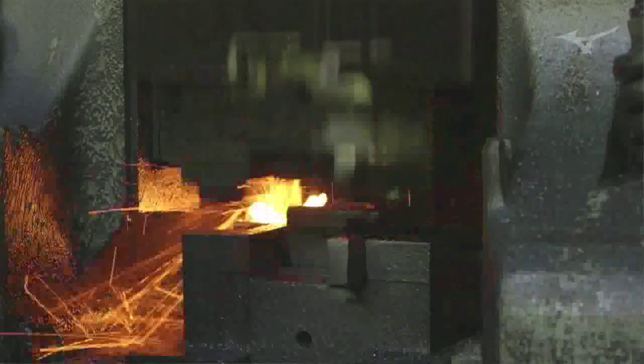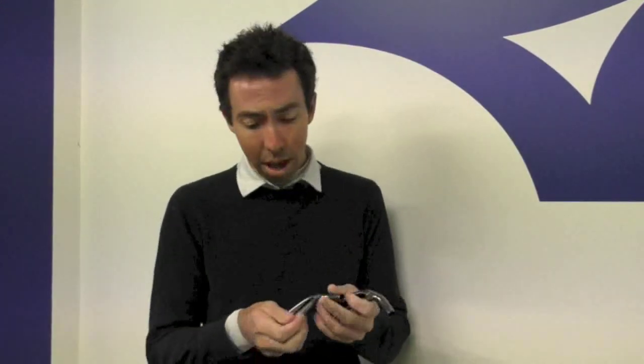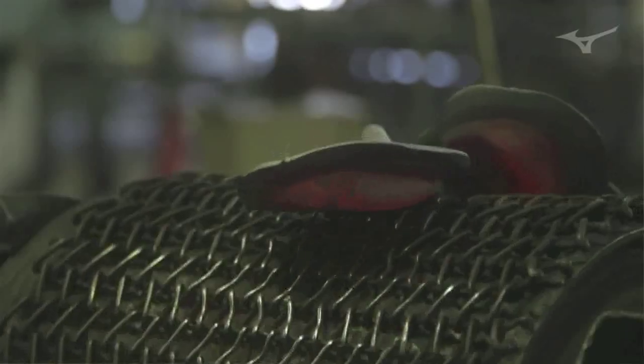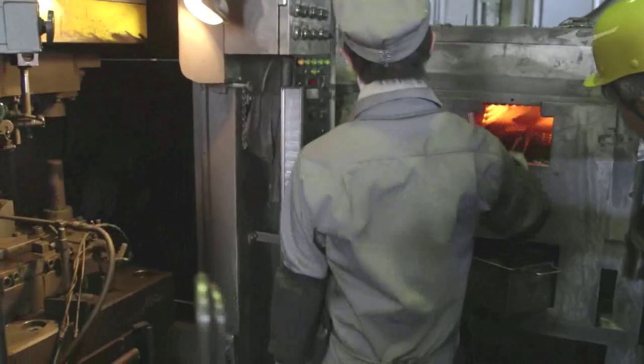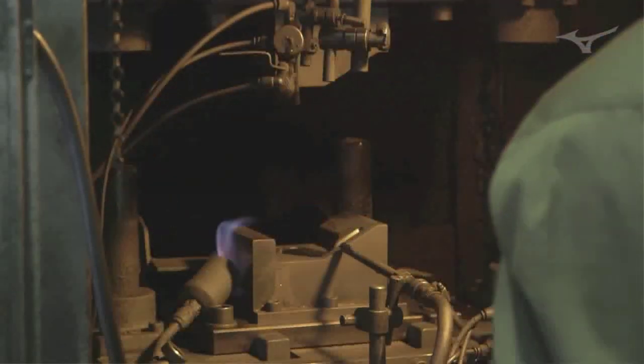The main difference between the two in terms of feel is that when the liquid is poured, you're going to get slight air gaps, so you're going to have a slightly less consistent feel on a cast golf club. However, on a forged golf club, you can control the grain structure, and because you're just forging it into shape and moving the mass around, you're not going to have those pinholes — so you get a little bit more feel and a longer duration of vibration.